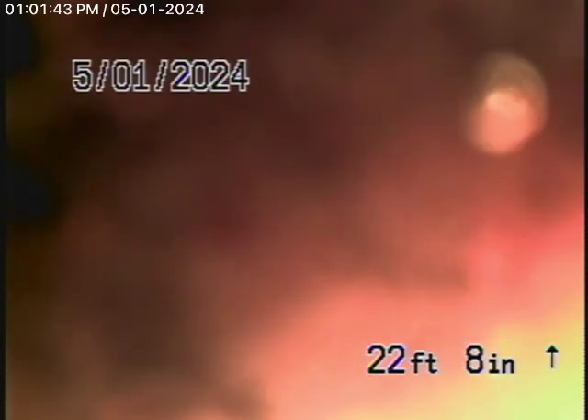We're running our camera from this 4-inch clean-out located here in the little crawl space underneath where the electrical meter is. We've gone in the line 22 feet where it kind of makes a U-turn, comes out the back, and we have a heavy blockage here in the line. We tried to run our hydrojetter through here but we don't want to get stuck, so we're going to stop there and bring the camera back.